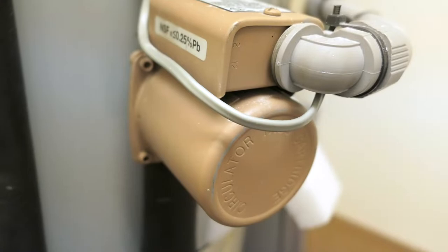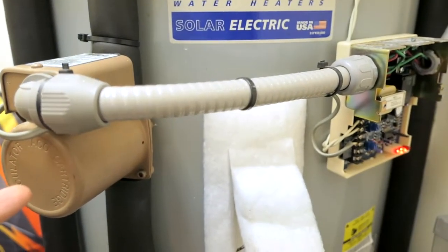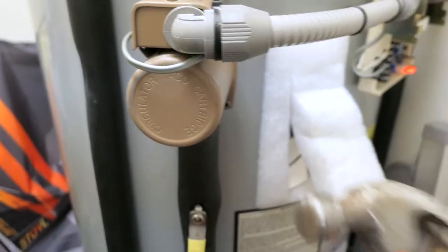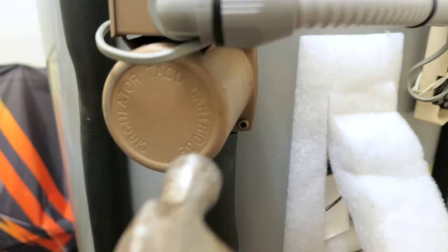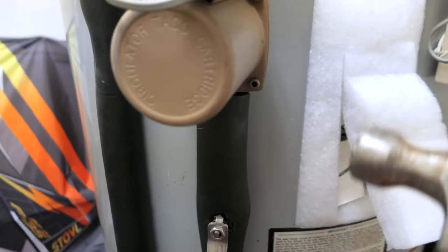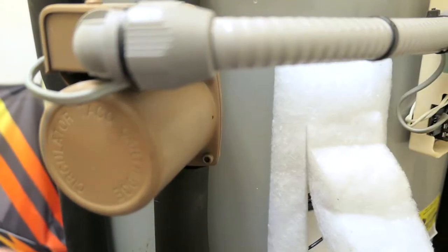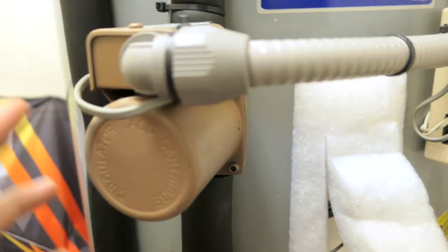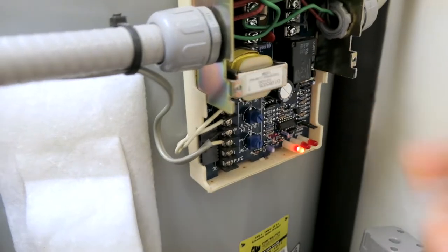I turned it back on to see if it goes, and it's not moving. Usually this is what happens — when it gets up to temperature it might want to cut on again but it can't or won't, or it waits till the next day and then there's no hot water eventually. Interestingly, if you take a hammer and tap it, it'll start up again. But when it's this hot it won't even start up with tapping. Sometimes it doesn't even start cold and a tap gets it going, so something's happening in there — I think it's shorting out.